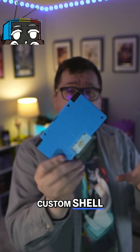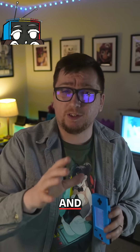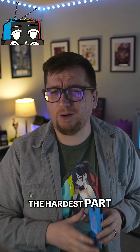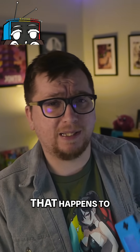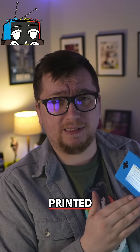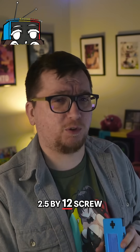They gave me this custom shell. All I needed to purchase was a 330 ohm resistor and, oddly enough, the hardest part of this build — some screws. To save anyone else with one of these 3D printed cases some headache and trouble, try an M2.5x12 screw.